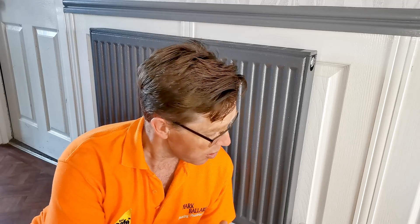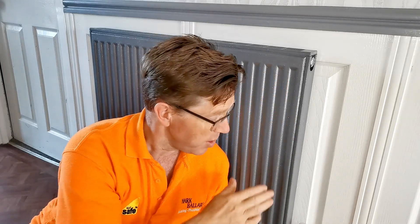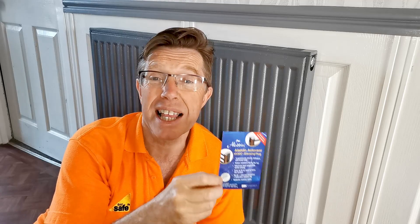It's now about 12 hours later and the heating has just come on. I'm not sure exactly how long it took for the air to vent out of this radiator, but what I can tell you is the radiator is now hot to the top. The Aladdin Auto Air Vent has done a really good job at venting out all that air right to the top, and it's done it automatically. If you're looking to purchase some of these, I've left the link in the description below.